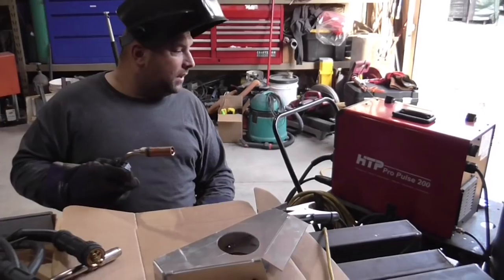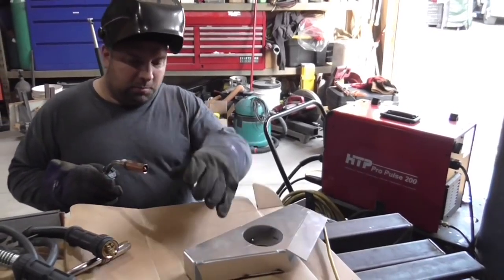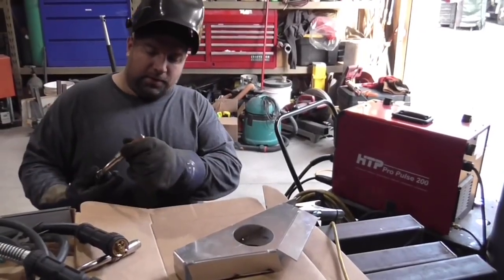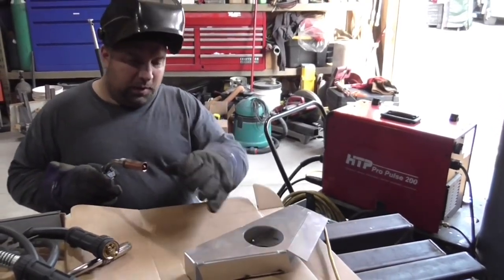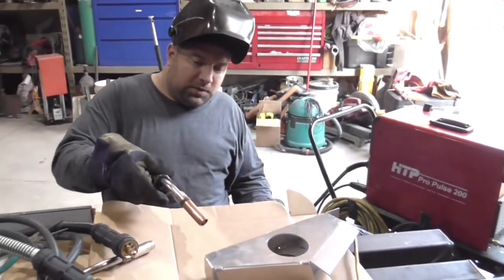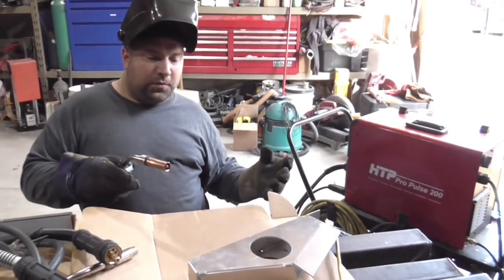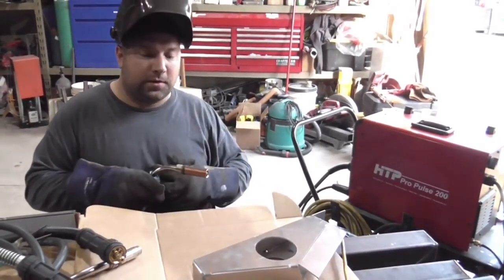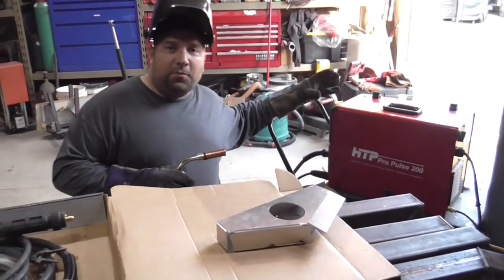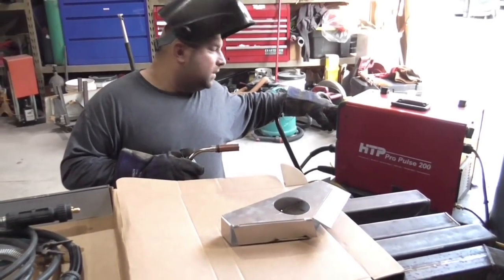So that's the alternative to TIG welding. Whenever you weld on cardboard, make sure it's OSHA-approved flame-retardant safety cardboard - do as I say, don't do as I do. The HTP Pro Pulse 200 has a program called Double Pulse - it's a pulse-on-pulse system where it makes it look like a stack of dimes, almost like a TIG look. First you see the hot start function; I didn't preheat the aluminum, it's still cold. There's a crater fill at the end that hopefully prevents crater cracking. Settings: 4043 wire, 0.035 diameter, 275 inches per minute wire speed, 35% hot start, trigger controlled, and 3-second crater fill.